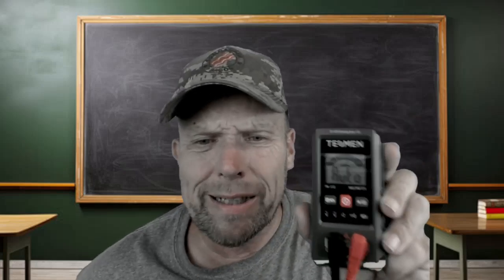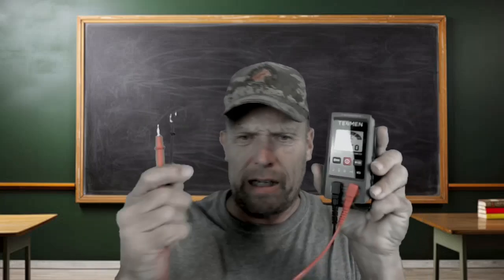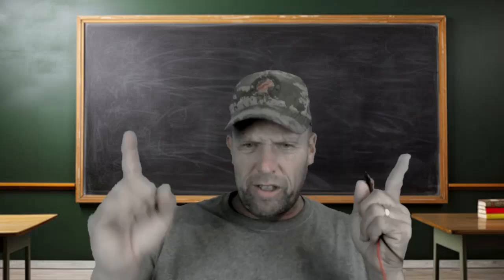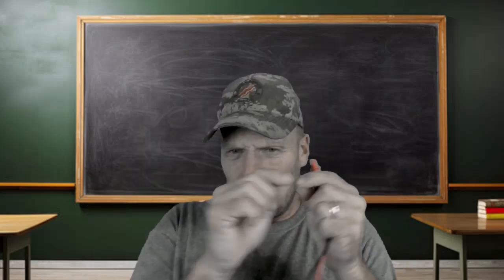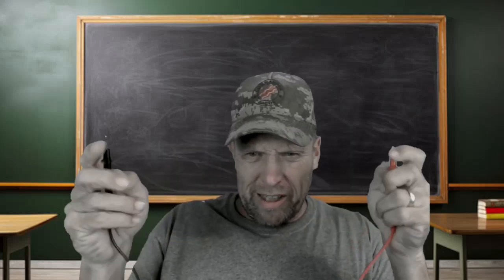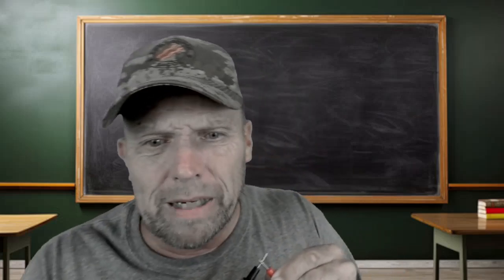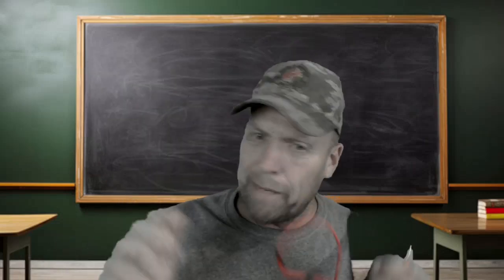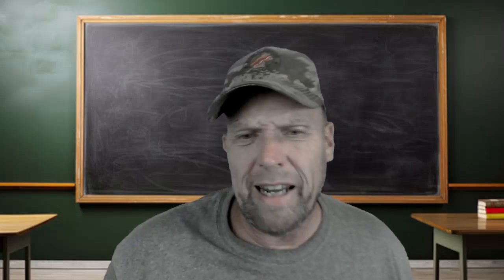Let's turn it on. Hold down the button. There you go. See what it says? Auto. All you pea-brain people out there, it's auto, it's easy. You got two leads. Let's start out with continuity — you want to test a wire to see if it's good from this point to this point, or is it broke in the middle? If you touch this end and this end, do you hear that beep? It beeps and then it shows you that it has no resistance.